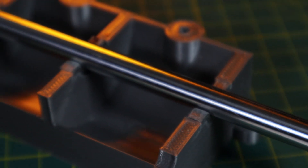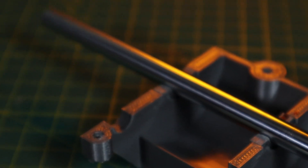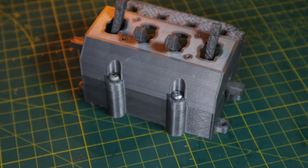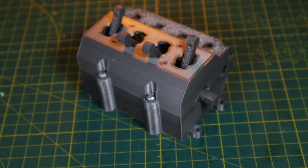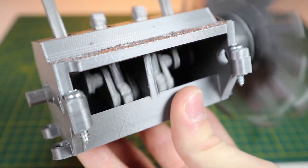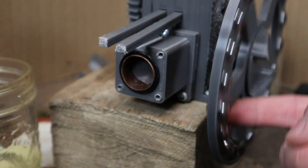After sanding all of the caps down, a steel rod shows that they're all even. Now I can drop the crankshaft in. As you can see when all the caps are put on and it's assembled, it spins pretty much like roller bearings would, even with a really light flywheel. Taking inspiration from my 3D printed gas engine project, I'm also going to be using copper cylinder sleeves.